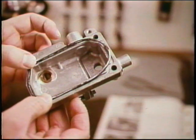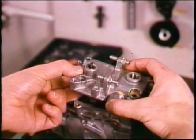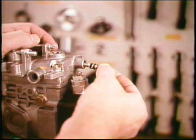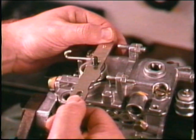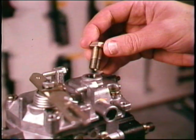Cover. Install the gasket in the injection pump cover. Offset the control lever shaft to the left of this spring assembly. Now push the control lever shaft up through the cover, but be careful to avoid damage to the O-ring or bushing. Fasten the cover to the pump housing. Now install the full load adjustment screw. With the shaft rotated counterclockwise and the return spring in place, install the control lever 90 degrees to the pump axis. Install the control lever bracket, washer and nut. And your final step, install the overflow fitting.